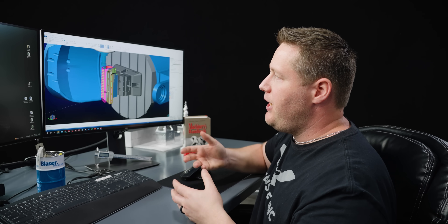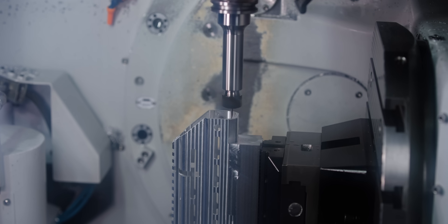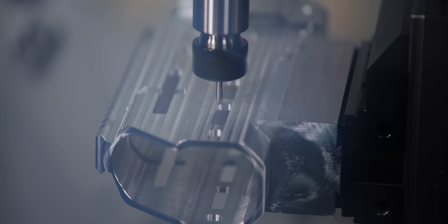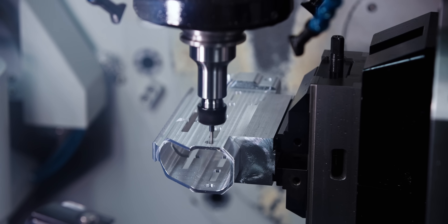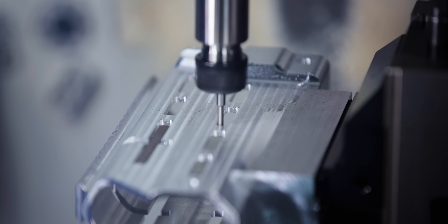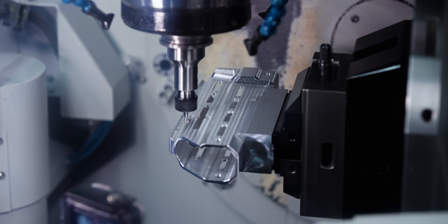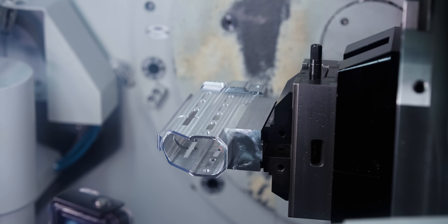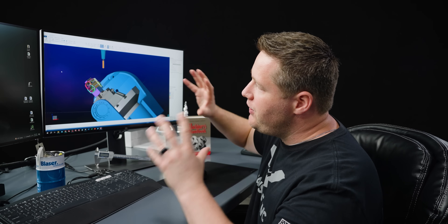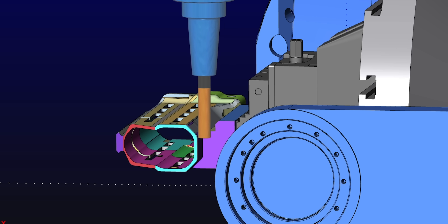Next, we're just going to take a 1/8-inch chamfer tool and chamfer everything that it can reach on the outside of this part. Then we're going to come in with a lollipop tool and that's going to chamfer the backside of our slots — because I do not like to deburr anything. This is going to make sure that when this part comes off the machine, everything has a chamfer, everything is deburred, and I'm not going to have to do any manual work to this part. Now that we have everything finished on the top side, we can start roughing away this material that's on the backside of the part.